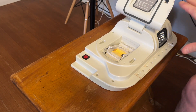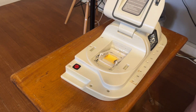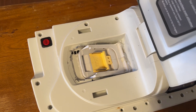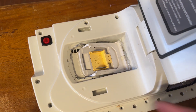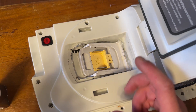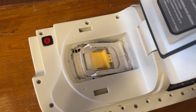As you can see, this is already modified. What I have done is a Makita battery conversion. The piece I have in here is from a Makita flashlight — I'm going to show you a picture of that right now. What I did with the flashlight is I just cut off the very back part, which is the flashlight portion. On the bottom of this piece, since it's at an angle, I actually had to cut it off. Let's go ahead and take this apart so I can dive into a little bit more of what I did.